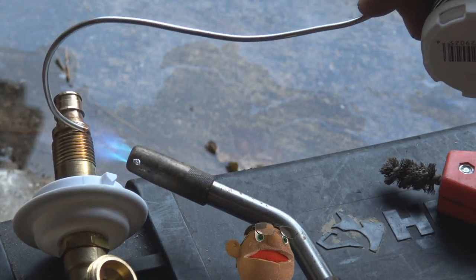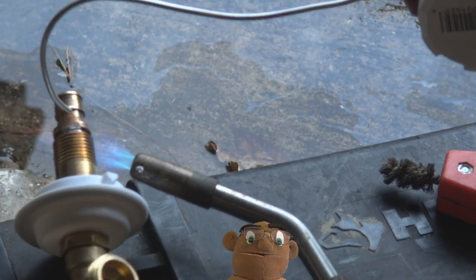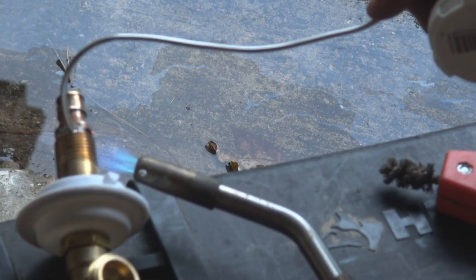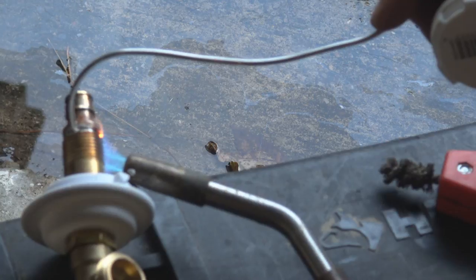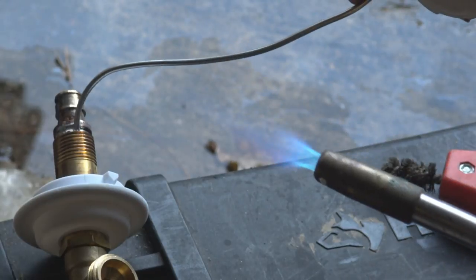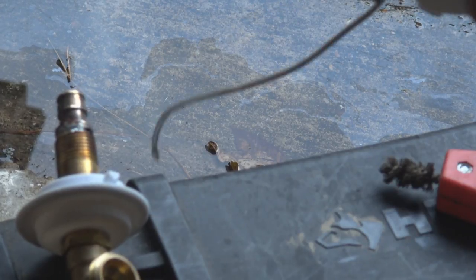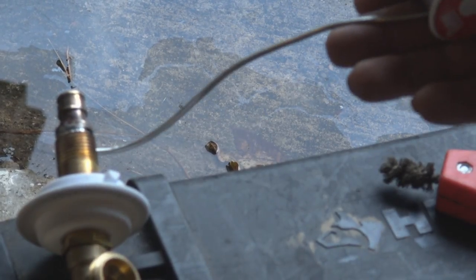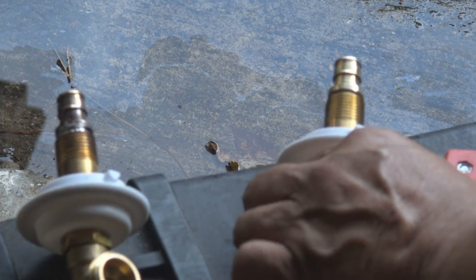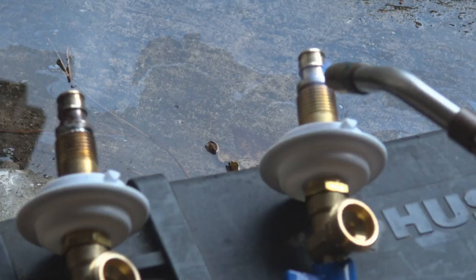And the setting we have here is a true setting. I mean, when you're on a job site, you don't have the time or the availability of brackets and things that you would like to have to hold your pipe steady, or the fitting that you're working on steady. So here you just have to improvise. I'm just using my little toolbox, just setting it and lightly soldering it. But if you feel you need some type of brace or vise, that's great. Go ahead, go for it.